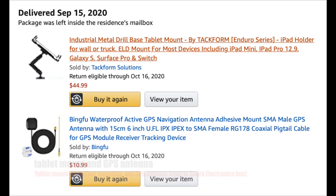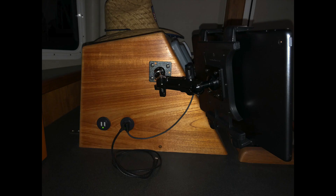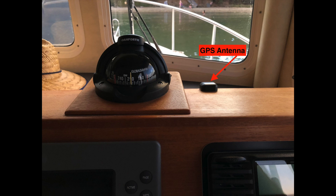I bought a wireless GPS antenna for good reception. Here's what it looks like on my helm — a picture of the front of it next to my Raymarine where I often run radar. The side view shows some USB connectors; those are Blue Sea USB outlets, and I'm just using short USB-to-Lightning cables to power the iPad. On that same console, I've routed the antenna out so it's only going through the layer of fiberglass above my head to reach the satellites, which has proven to work pretty well with no issues.